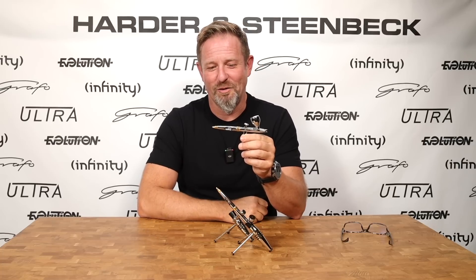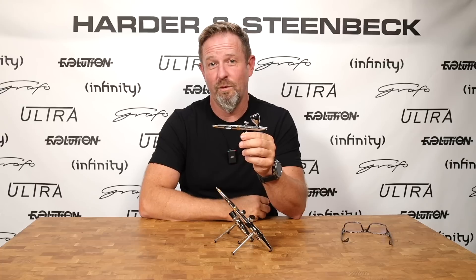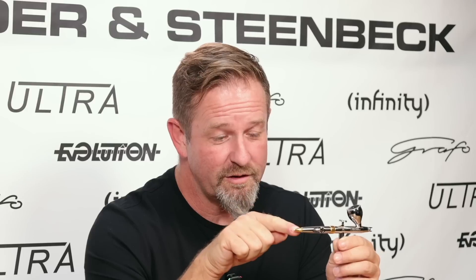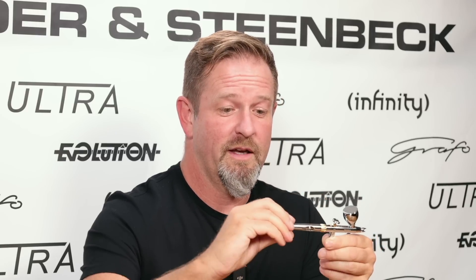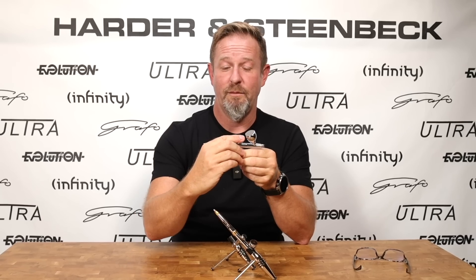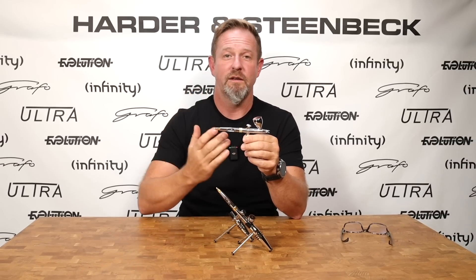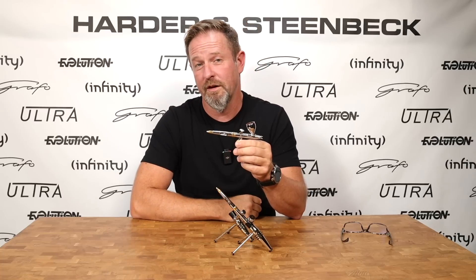What we've done here is really cool. We've borrowed something from Formula One — their wheel nuts, which go on extremely fast because they use multiple-start threads. The thread in the back end of this airbrush uses a triple-start thread, meaning that when you turn it one turn, it moves three times further than a single-start thread you'd normally find. Much more difficult to machine, but we do love a challenge and it's turned out beautifully. So here, for example, it's fully free, and if I just give it one full turn I'm almost completely closed on the trigger. It's much, much more user-friendly and usable than what we had before on the Silverline Evolution.